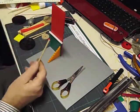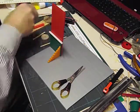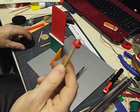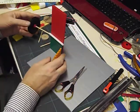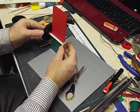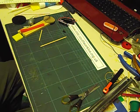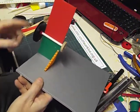We're going to use a 4mm dowel here. For this axle we're going to have a small pulley on one end and then a large pulley. We slide that through, and then to stop it falling out we'll just stick something on the end. Always keep glue well away from any moving parts — I've just put some glue on the edges to fix it in place. So that's our first driven axle.